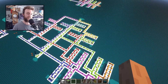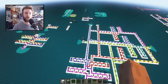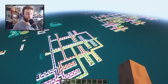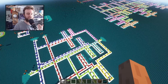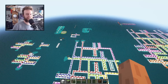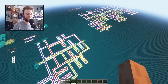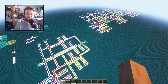With all that we've got enough to do addition. The output is the XOR of the two input bits and the carry-in — like if we carried a one from the previous digit. The carry-out is kind of weird: we essentially output a one if at least two of the inputs are turned on. To check that we have three AND gates: one that checks if the red and blue lines are on, one that checks blue and green, and another that checks red and green. So right now this circuit is essentially saying that one plus one with another one carried in equals three — that's the dumbest thing, but your CPU does have a circuit of this type that actually does addition inside of it.